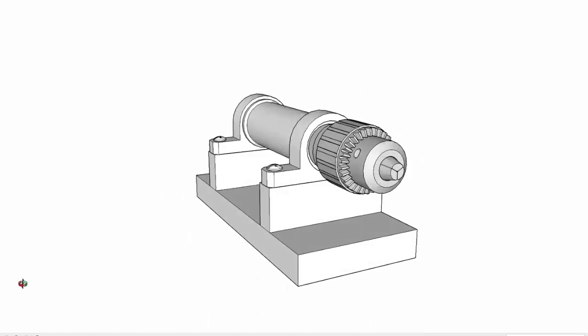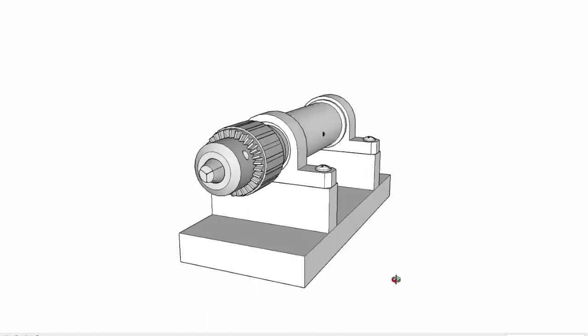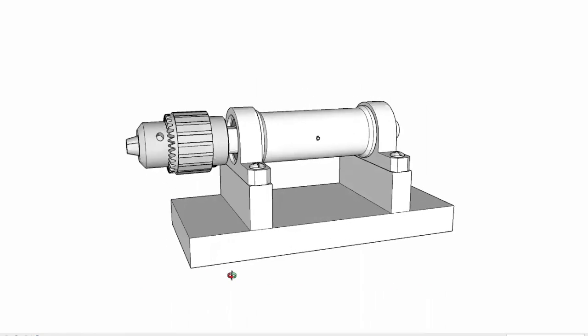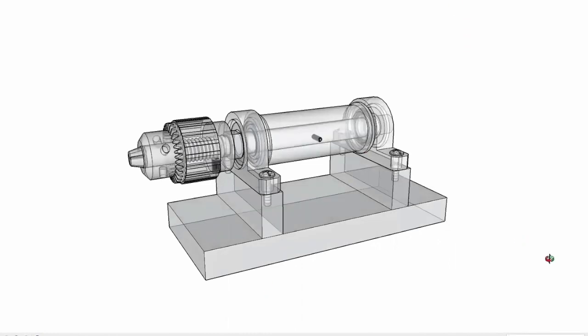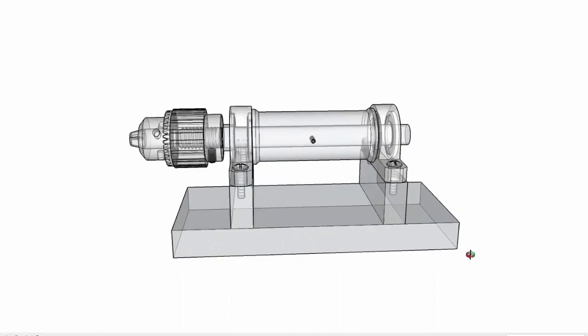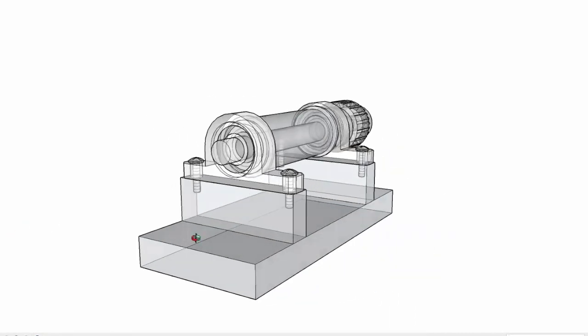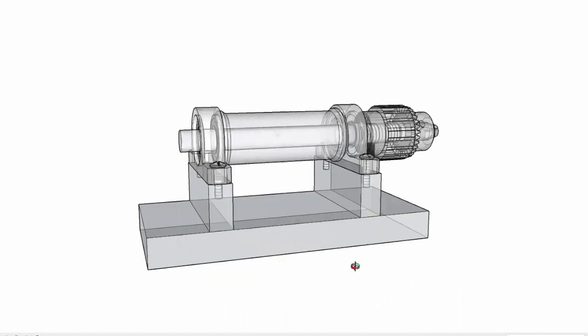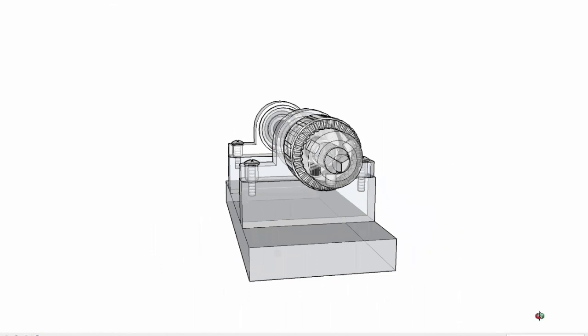Not only does this tool offer smooth and safe drilling operations, but perhaps more importantly is the feedback it offers to the operator. It's an extremely sensitive tool and really prevents the splitting or damaging of the stick of a bow when forming the nipple or drilling for the screw. The foret is also used for starting the hair mortise in the head and frog, as well as for drilling the recesses on the cheek of the frog for the pearl or Parisian eyes.